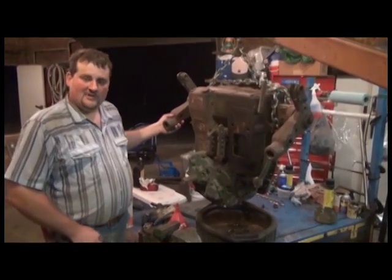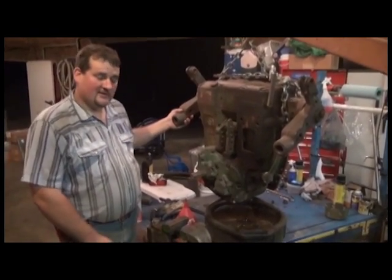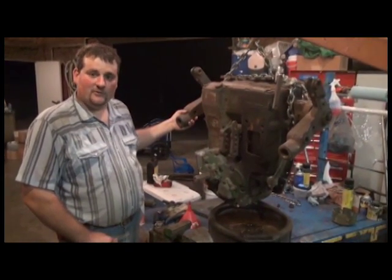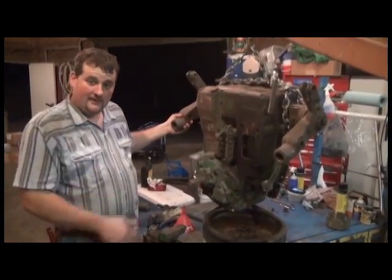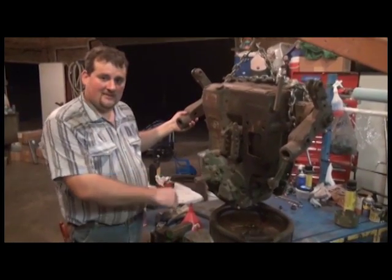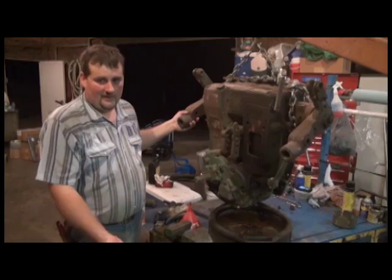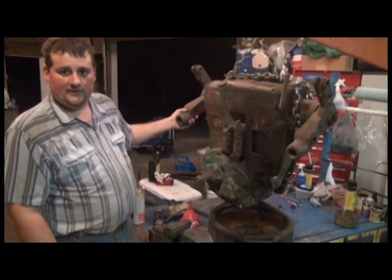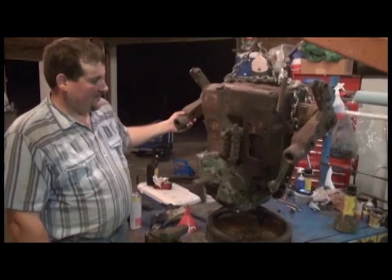So that power comes off your crankshaft along your reduction cover, your clutch pulley into the transmission, and through a series of bevel gears, power is redirected and transferred back via shafts to the rock shaft housing on your tractor. Or it may not be the rock shaft housing, but at least the rear cover and the housing that would encase the power shaft clutch.